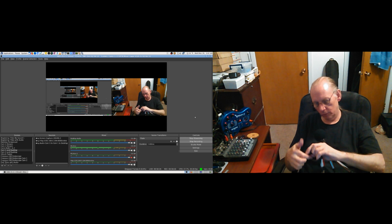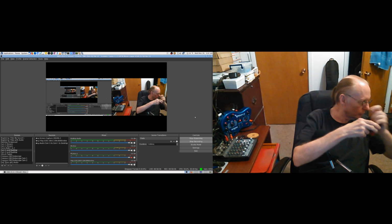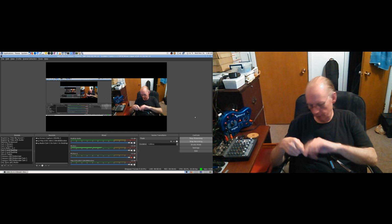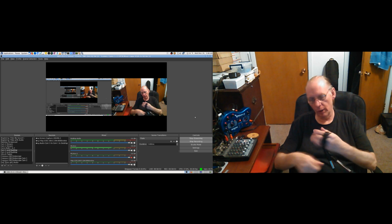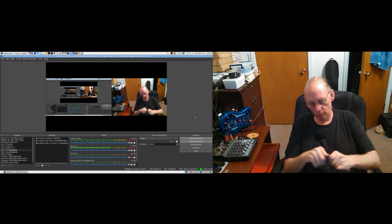Okay, now as far as why that, I don't think the board does what the impression I got from the manual said. It said stereo, but I think what it really meant was balanced, because that's the way it's behaving. So I could have two. You'd want two actual 1/4 inch cables to do it right. But you can balance two balanced cables coming from whatever source.